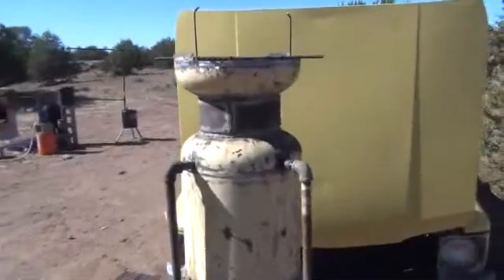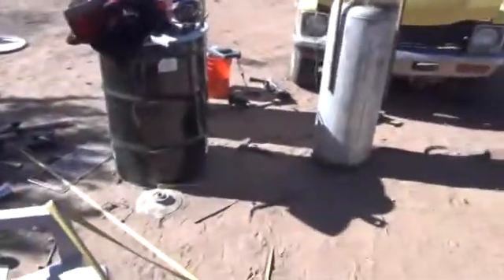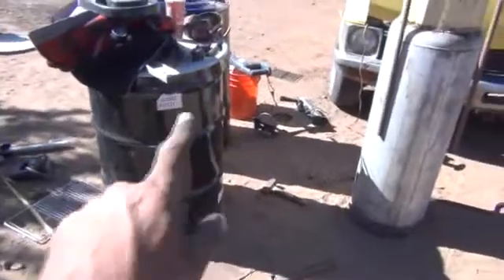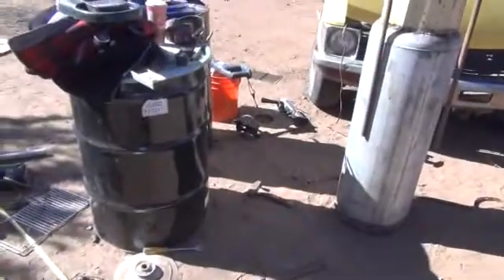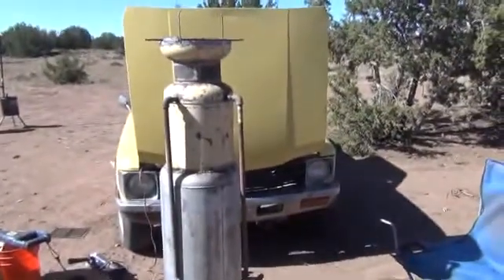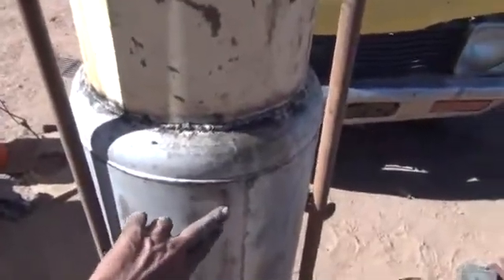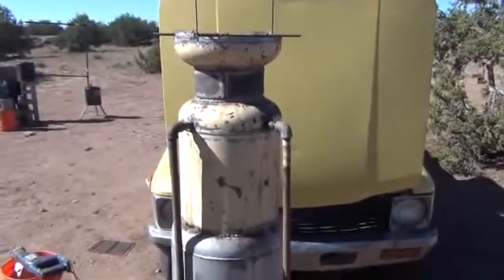Now that we've gone through and shown you the finished reactor — just the cable to connect later on — I'm going to remove the screen, pull off all the metal, the pipes and everything, now that I know where they go. I'm going to start mounting this entire reactor now. That system is going to mount inside of that barrel. I'm going to cut a hole in the lid of the barrel while it's all clamped down and weld while clamped. Start out with tack welds so you don't warp the steel — that's going to be the main key, not warping the metal on the lid of that barrel. It's probably only going to sit down to about right here, and the rest from here all the way up will be inside the barrel. Everything else will be either outside or inside a secondary barrel, and we'll try to find another barrel to cover that for more insulation value.